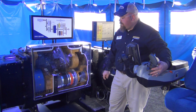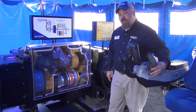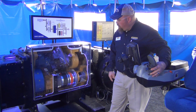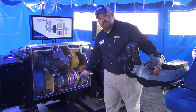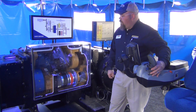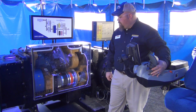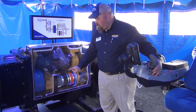As we increase in speed, you'll see the ring gear, from a stationary position, start turning in a counterclockwise direction — we saw it turn clockwise before. As we continue to speed up with the tractor, you'll see these two clutches have matched speeds, and now clutch number two is activated. The ring gear will then start to slow down again and get to the zero point. Once it hits that zero point, we are at 100% mechanical efficiency in clutch number two.